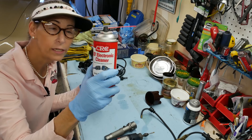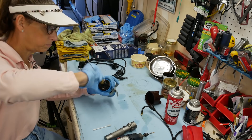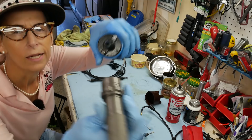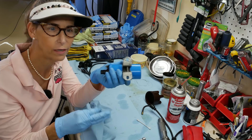I have some dedicated electronics cleaner — this stuff really cuts through exactly this sort of corrosion. Use a Q-tip to swab it around in there, then hit it again with our brass brush and blow it out a little bit. That looks pretty good in there. It's a little hard to see, but I think we've got our corrosion cleared up.